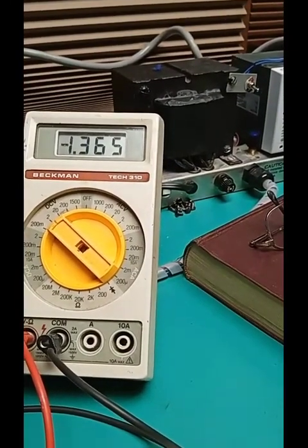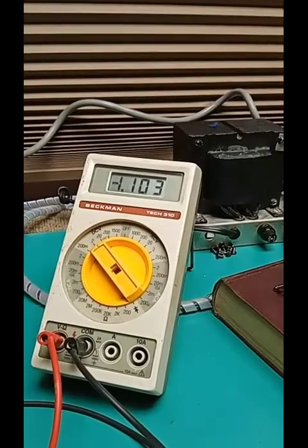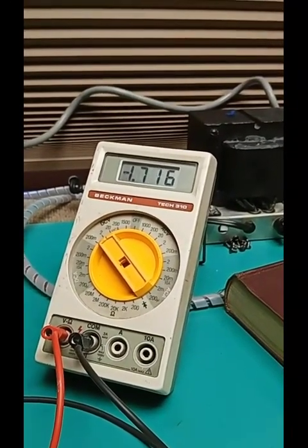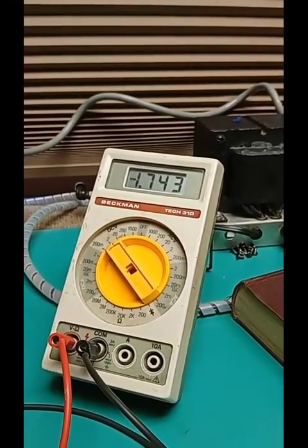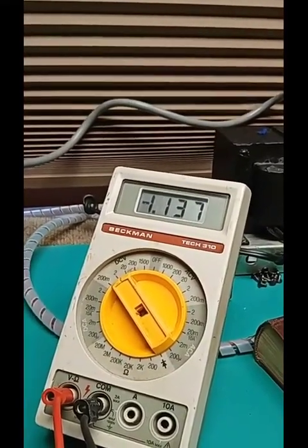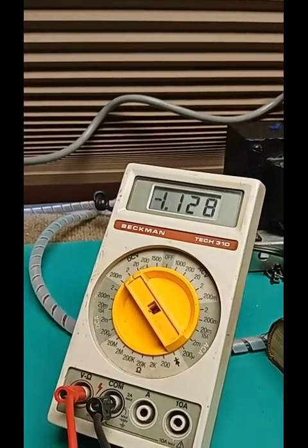We get not quite so radical a response. There's about peak. Now on 40, adjusting T3 bottom, way off, horribly off, because I tried to do it by ear without the alignment load. 1730, 1740, right there. And for 15 meters, same procedure, drops off, peaking up, dropping off, and back to peak.